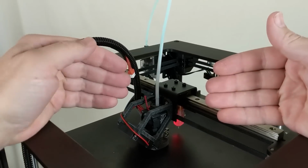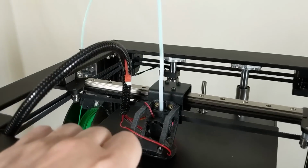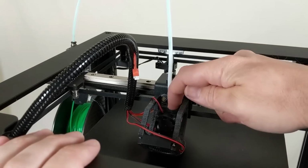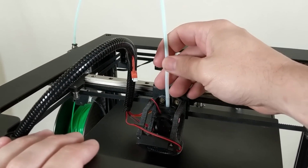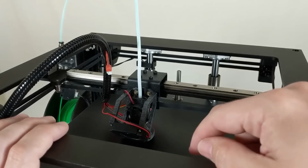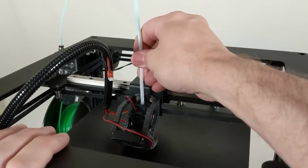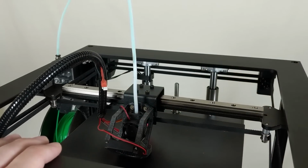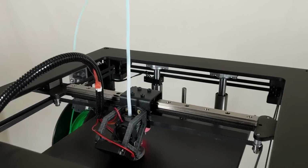And here's the whole assembly fully installed. I did not tell you guys before, but I basically put that little captive 4mm nut inside this little plate, and the Bowden tube threads into it. You've seen me do this technique before in my other videos. So it's a nice lightweight solution that absolutely has no movement in the Bowden tube. So very nice way to accomplish that task.